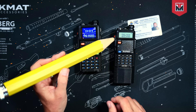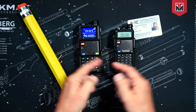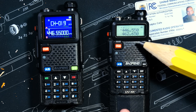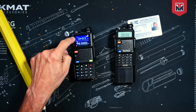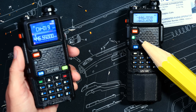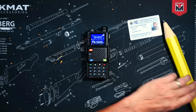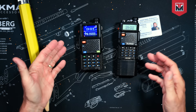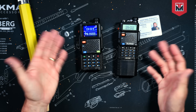I'm going to use the AB button to ensure that the upper frequency is set as my transmit channel, as indicated by the little arrow thingy. And just like the other radio, because TDR or dual watch is enabled, it will also be listening on the lower frequency line, which is 462.650 MHz, GMRS channel 19. And now this is where the magic happens. When I transmit on this radio on GMRS channel 19, the other radio will hear it, as you can see by the receive indicator. And when I transmit on that radio — which you will notice I am doing off camera, because of reasons — this radio will hear it. However, anyone listening to either one of those frequencies is only going to hear half of the conversation, because we are now transmitting in halfplex, which means being half secure.